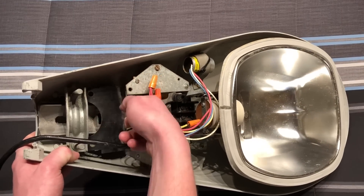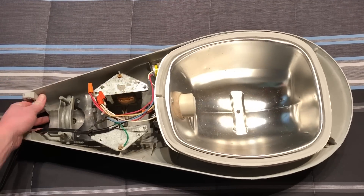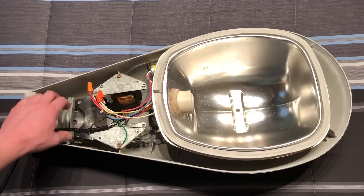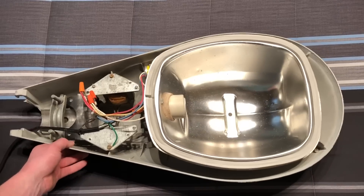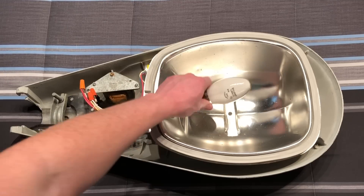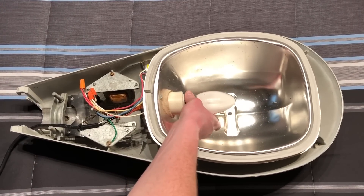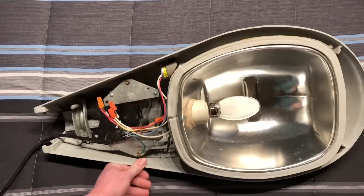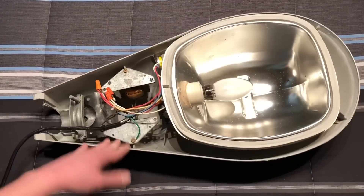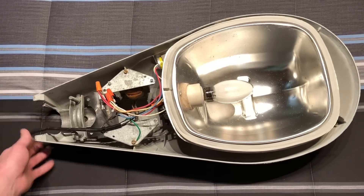It's pretty simple. We do have what I'd call a bird guard — it's probably put on wrong, but I just put it in there so it stays with the fixture. This brace is bolted all the way down and you can't fit an arm in here currently, just so it doesn't rattle, because I want to use this more as a novelty item in a home than an actual usable fixture — that's why such a low-wattage high-pressure sodium bulb. I could have gone with mercury vapor or something like that, but I wanted to keep the fixture original to its roots and keep it high-pressure sodium. You may have noticed the sticker in this fixture — the one that would have had the date code — is missing. It was destroyed beyond belief when I got it; the paper sticker was pretty bleached out.